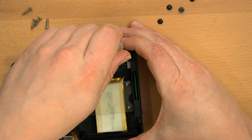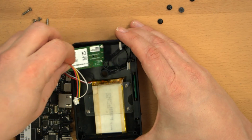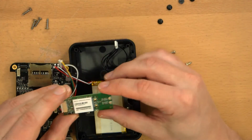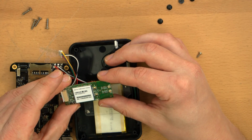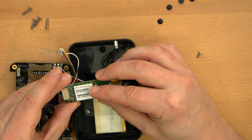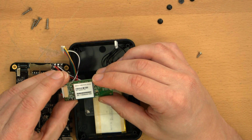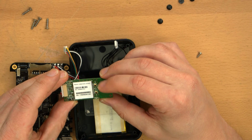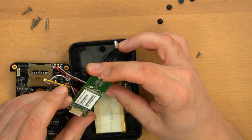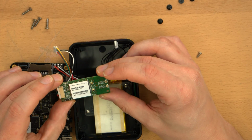So let me take a look at this random card in here. And it's not that random. I'm wondering if this is, well, no, I was going to say maybe that's an Ethernet cable, but wow, that does not give me much information. The model number is WUBM273ACN. I'm guessing ACN is for 802.11a, c and n, but no, you'd figure this would be 802.11b compatible too. It does have 2 connectors for external antennae, and actually 2 more over here. It's got 4 connectors. And it has a MAC address, so I'm pretty freaking sure this is a Wi-Fi adapter.